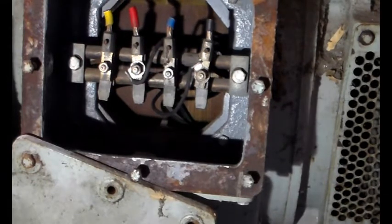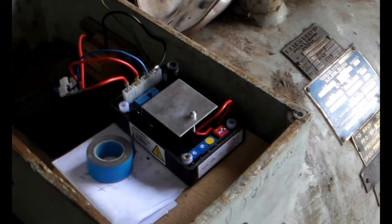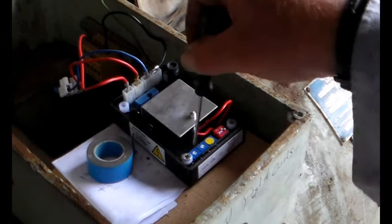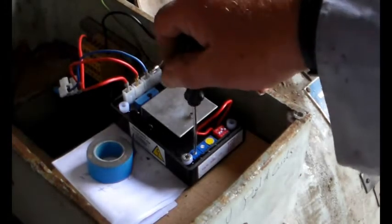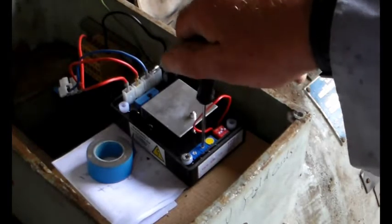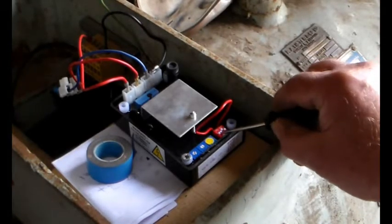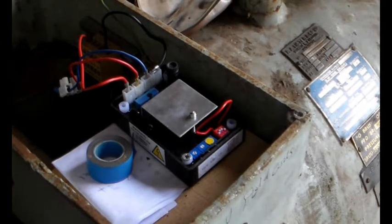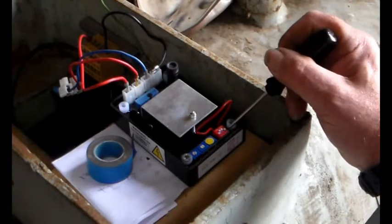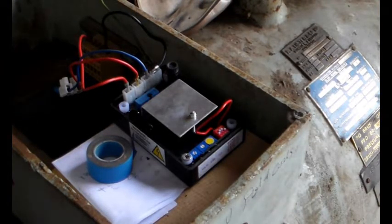I think we're nearly ready. Let's go back to the list. What does Eddie say? He says turn the volts adjustment down to low. I'm going to put the stability about the middle, and that dip switch moved to slow. So we've got those set on 240 volts, slow, and 50 hertz. And as we know, the engine is running virtually at the right speed.